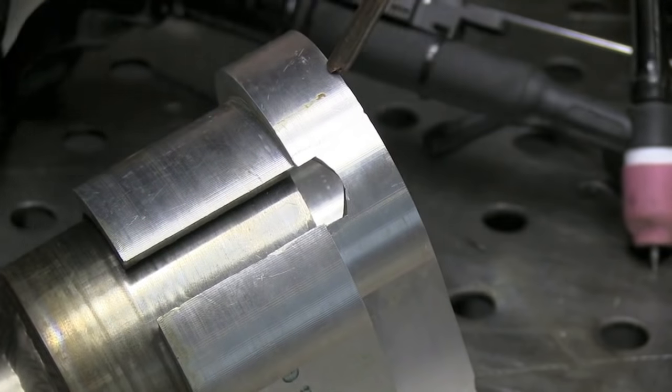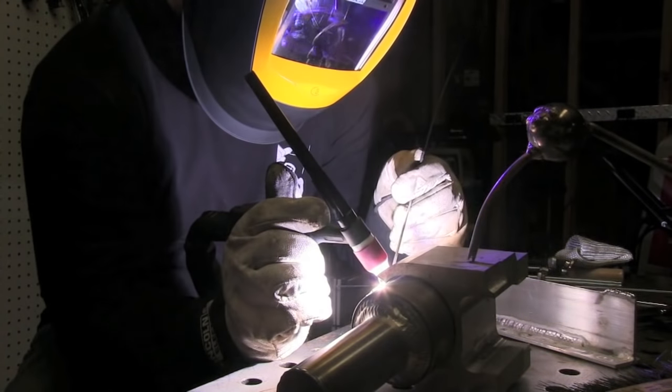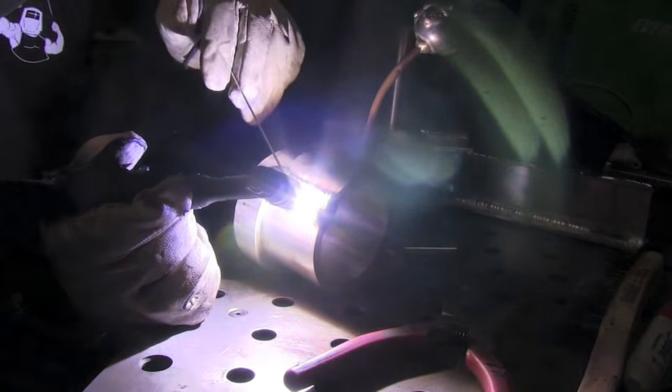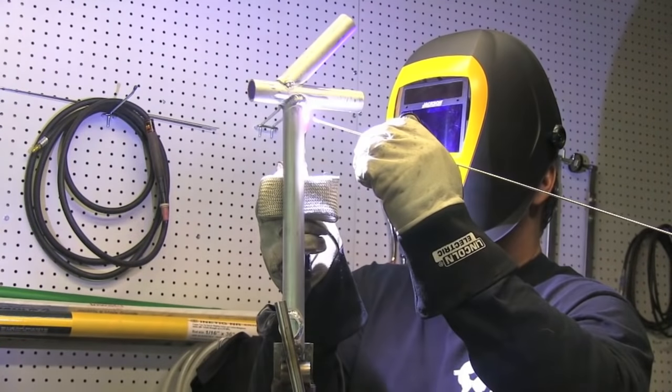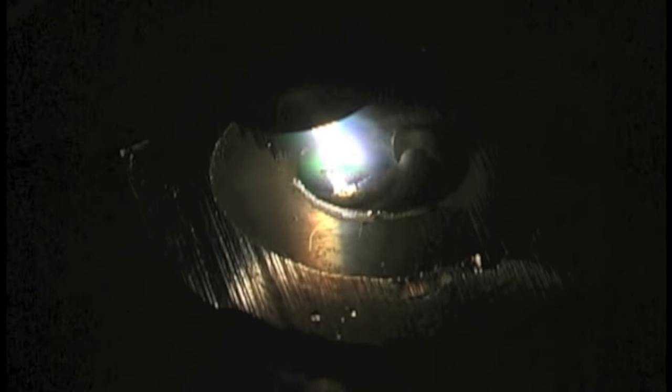I'm doing a little manual pulse TIG welding on some aluminum thin wall tubing here with a foot pedal. Here I'm using some thick stainless steel backing to weld a big gash in an aluminum part. Stainless steel backing traps the argon gas and also provides a way to cast the weld metal — makes it a lot easier than welding without it. Here I'm using a torch switch on thick steel using upslope and downslope instead of a foot pedal. To fill an aluminum hole, use light amperage and let that cleaning action do a little work for you before you ever puddle the metal, then as you're filling it in and tapering off with the foot pedal, keep that torch moving around to prevent leaving a crater.